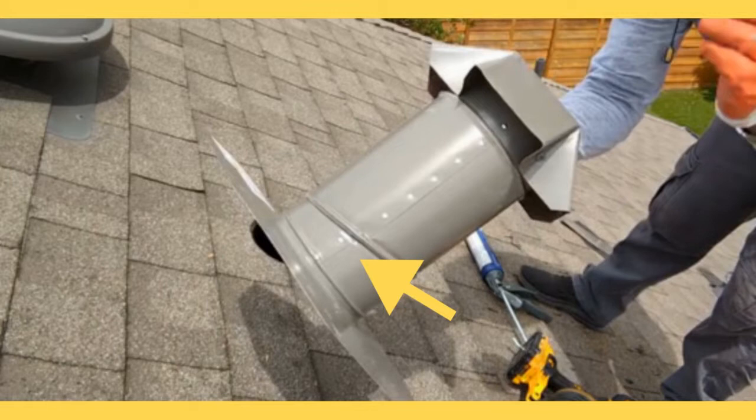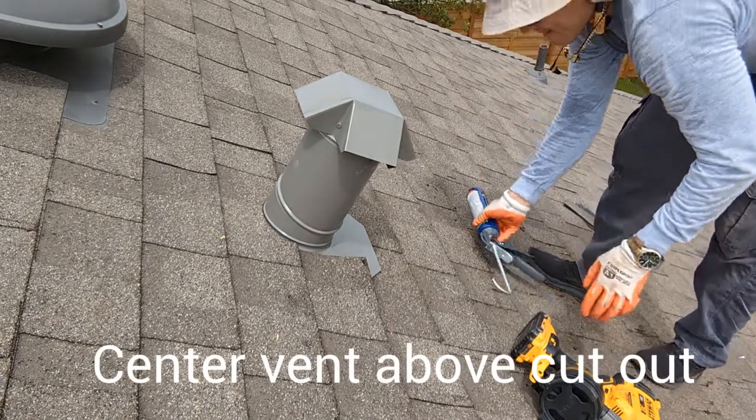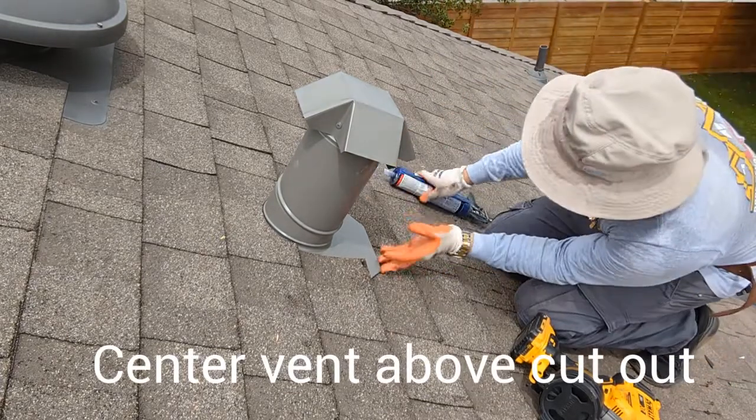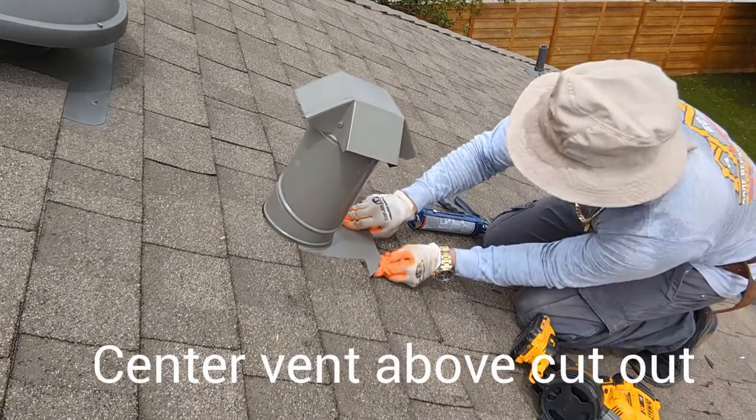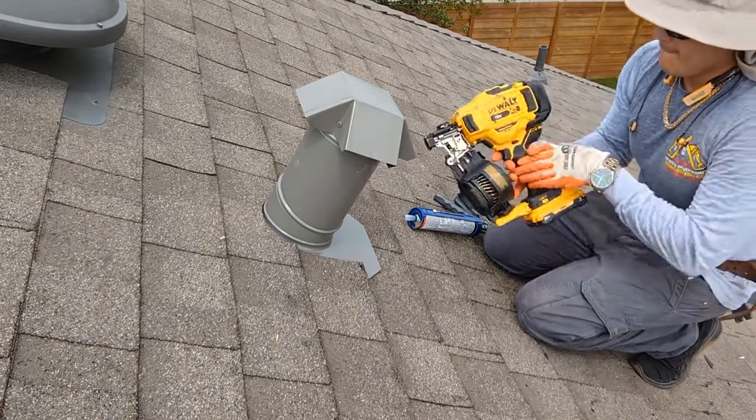The reason why this side is placed facing the ground is because these flashings at one point were started with one flat sheet of metal, similar to a sheet of paper, and fabricated round, but because of this, the seam where the metals connect is a weak area. It can allow water leakage, and facing it downward, opposite side of the water force will prevent this type of roof leak. Think about it, it isn't a solid tube, it's a sheet of metal made round. This same rule applies to all the other metal flashings, not just the roof jacks.